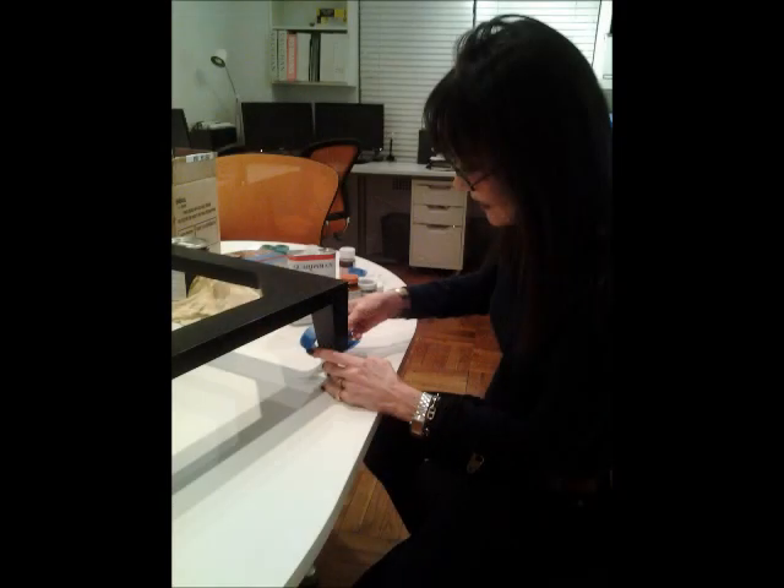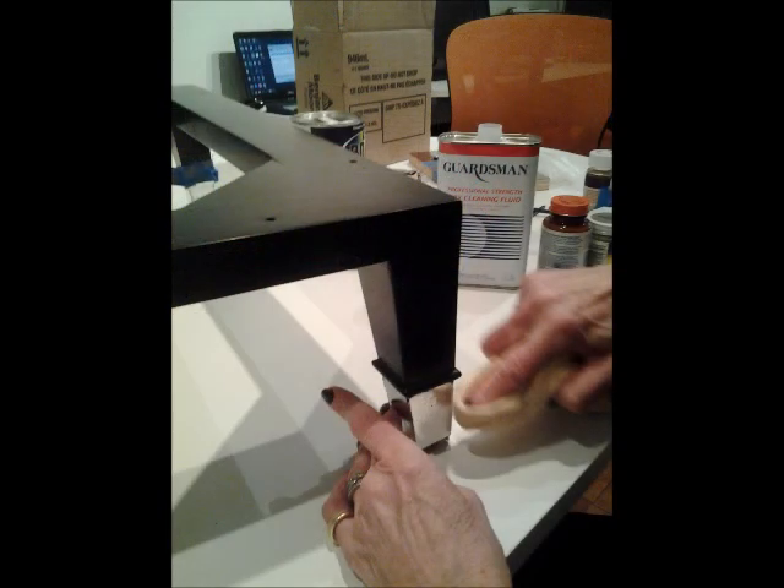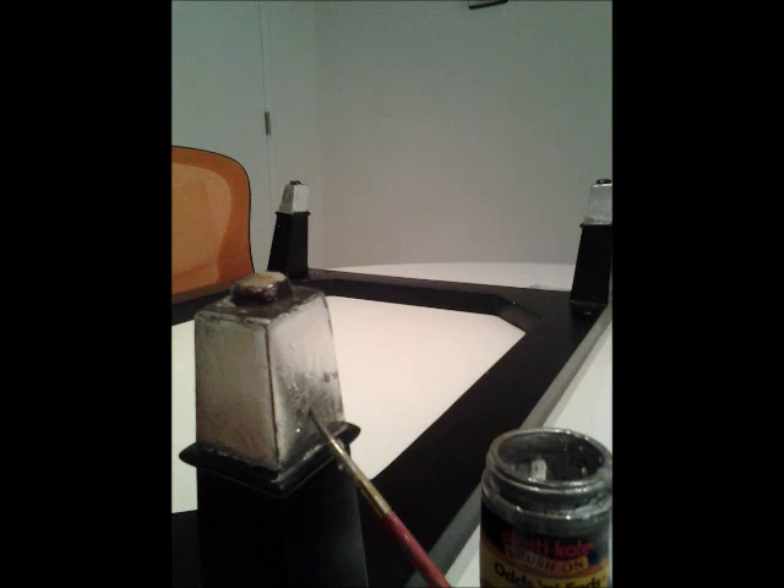After all the silver leaf was completed, we had to gently remove the blue tape so that we can get to the faux finishing. Gently smoothing it down and taking off the excess with a very soft chamois cloth, which you could buy at any paint store. With the nickel color paint — an oil-based paint — I started putting in some of the little dots and some of the imperfections and the veining that you would find in a more mercury type silver.